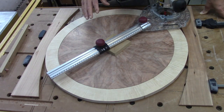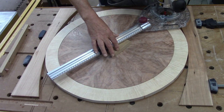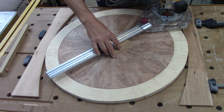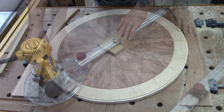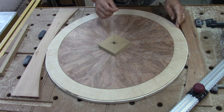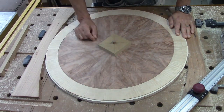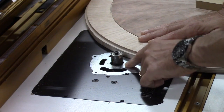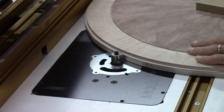Now that I've got that groove cut for the inlay, I'm going to work on sizing the top to its final dimension. I've got my trammel arm set to 24 inches and I'm going to plunge down an eighth of an inch first. I'm going to make a climb cut — I don't want to chip any of this out, so I'm going clockwise. I made that initial cut with no tear out, so I'm resetting the router to a quarter-inch depth to give myself a quarter-inch deep rabbet. Then I've got a pattern routing bit on my router table to remove the material all the way around the outside.